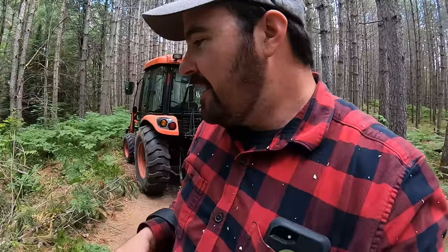There's just something about a freshly sharpened chainsaw. You guys saw me cutting there. I was just about ready to cut the rest of the tree, not because I was going to use it, just because I wanted to let her go. Cutting the rakers way down, as you saw, making the chain nice and sharp, gives it a little bit of extra gusto and makes it kind of fun to keep cutting.